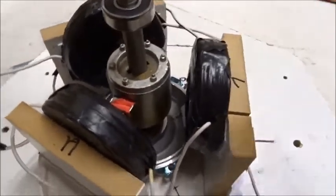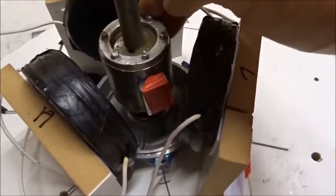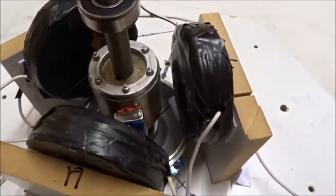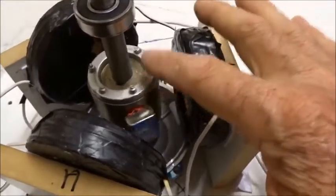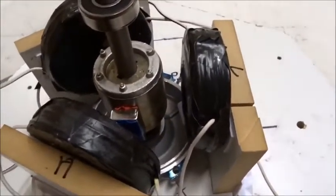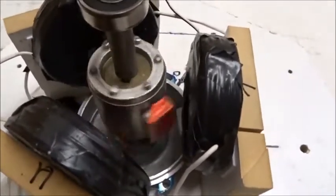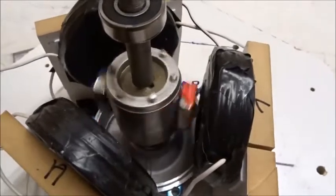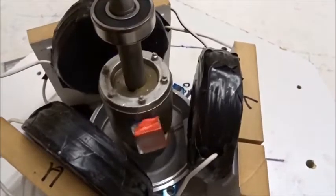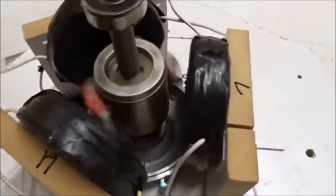Just to carry this line of investigation a bit further, suppose we put two somewhat larger neomagnets — north that way, south that way — like a bar magnet across the middle. We have to move the coils a bit further apart. Realistically, these could be set into the steel, but I have to work with the steel rotor I've got. We turn on one hertz of power — you see it spins the same direction as the iron at much higher speeds, but only at one hertz. The iron won't even move here. These would have to be set into the rotor closer to the iron. And we speed the thing up — it spins very, very powerfully indeed.